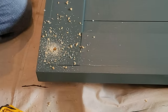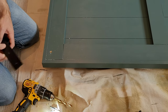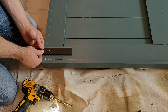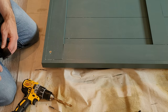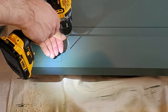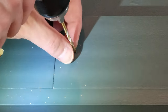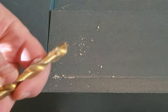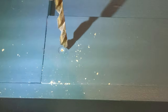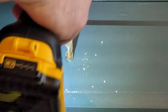This bit is actually the exact size of our bolts and screws. I would say it's okay to go a little bit bigger on the drill bit — we had to use a ratchet to get the screws pulled through, which just means there's no wiggle room and they're in securely. Here's a close-up: he's guiding the larger bit, making sure it's perfectly centered. Have somebody eye this part and try to drill straight down because you don't want your screws going in crooked.